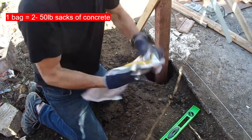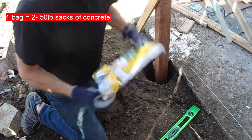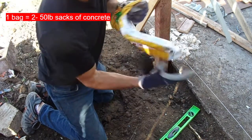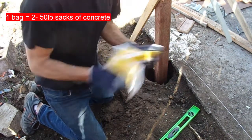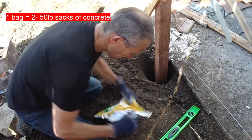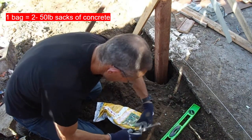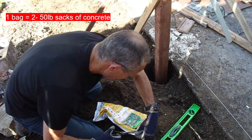Be aware that you don't want to go over the 15 seconds. If you go too long, the foam will start expanding in the bag and then rupture the bag, and you'll just have to throw it away. So that's 15 seconds — got the scissors right there handy, and you cut that corner that's designated on the bag.